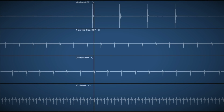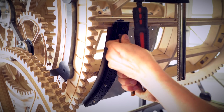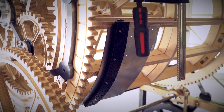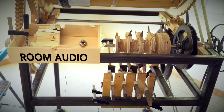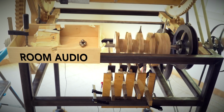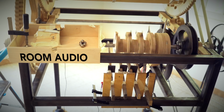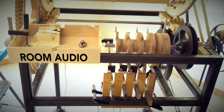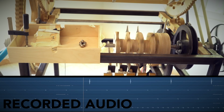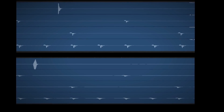So the first test showed me exactly what I wanted to see. The marbles are out of sync, but they are consistently out of sync, which means that we can adjust for that. So only for this first test, I'm moving the program 1/16 earlier, so the marbles will hit earlier. This is not the real adjusting method. It's just this first test. Let's see how close we get now. When comparing the two screenshots, you can see that the marble hit have moved exactly 1/16 to the left.